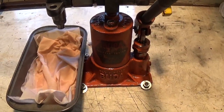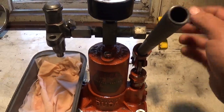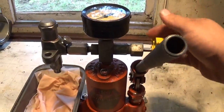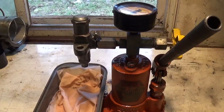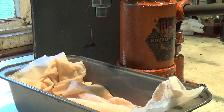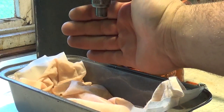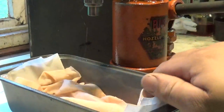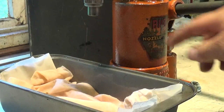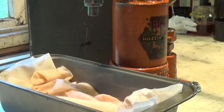I've already got this unit filled up with clean fuel oil and I've got it primed up. Let me close the valve here for the gauge. We'll just actuate the handle here a few times and see what our spray pattern looks like. Always wear glasses when you do this, and never ever ever get your fingers or your hand underneath the nozzle tip. So I'm going to give it a few strokes and see what the spray pattern looks like.